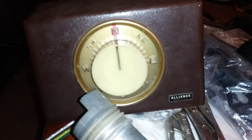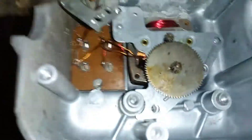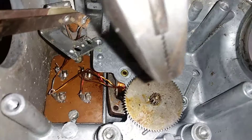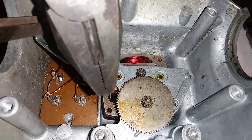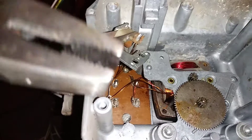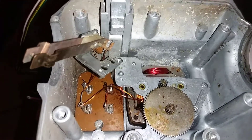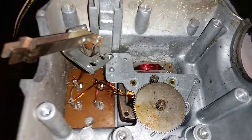Here's the controller I just got from eBay. I'll show you the way this thing works. It's running off a worm gear, and then there's another gear — a cam basically — that has a little bump on it. It goes along and hits a reed switch, and that tells it how far around it's gone, which tells the box, which pops a solenoid, and then it moves.